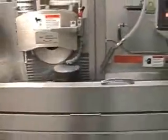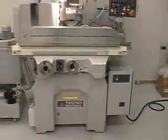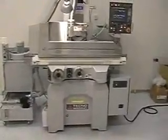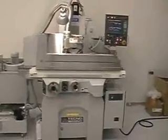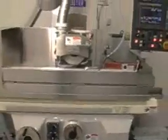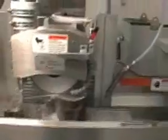The machine itself is 4,600 pounds. It is a very, very massive base with very wide support for the cross. It has a linear scale and a cross feed, and they are roller guide systems — not a ball system, a roller type system. Very, very rigid and very, very accurate.